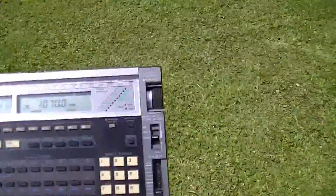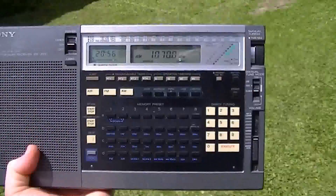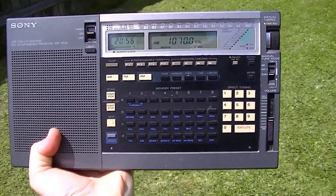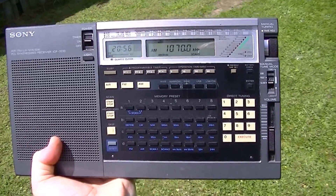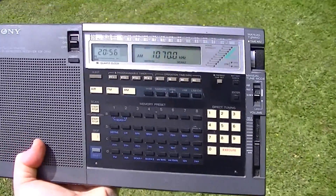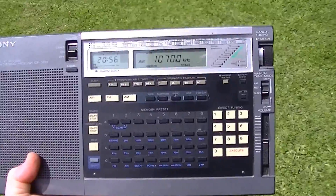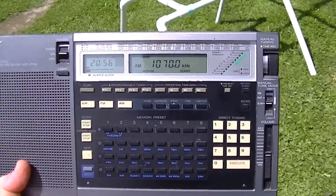In order to do this, I will take an ICF 2010 barefoot model, point it toward Victoria — the source of the daytime DX signal, which is 99 miles away. Right now it's pretty close to bright noon. I have no LED indication on the ICF 2010, but I have the loop pointed toward the northwest, which is CFAX's direction.